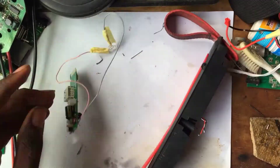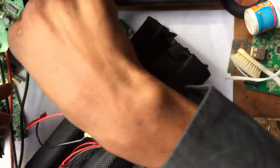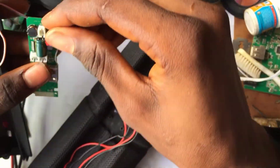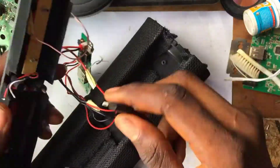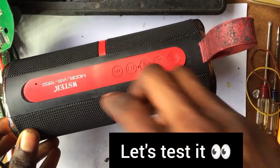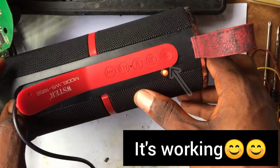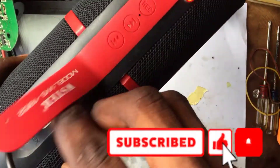Now start coupling. First create a provision where the LED will come out from the casing of the Bluetooth device, then connect your battery terminal and the speaker. Check if it's still functioning efficiently. Plug in your 5V DC charger — as you can see, the charging light is now displaying. Let's also test the Bluetooth to confirm it's still working. Don't forget to subscribe to my channel.